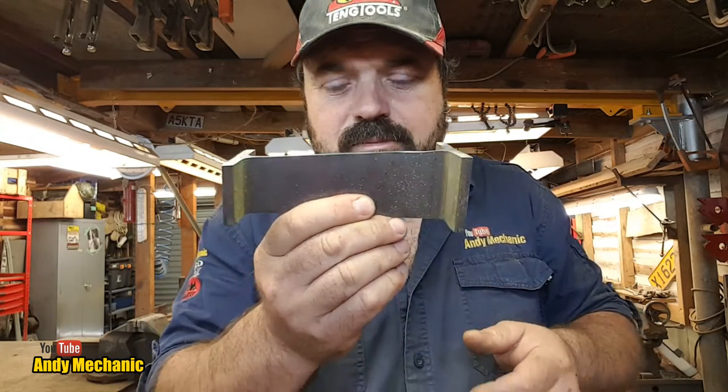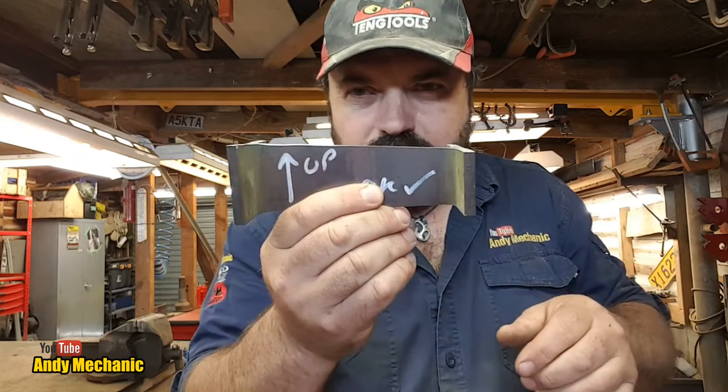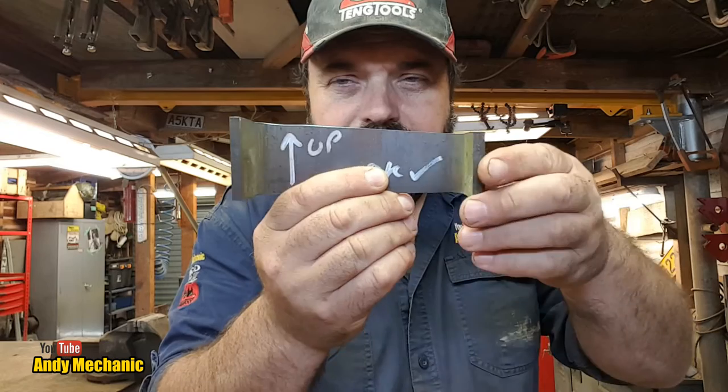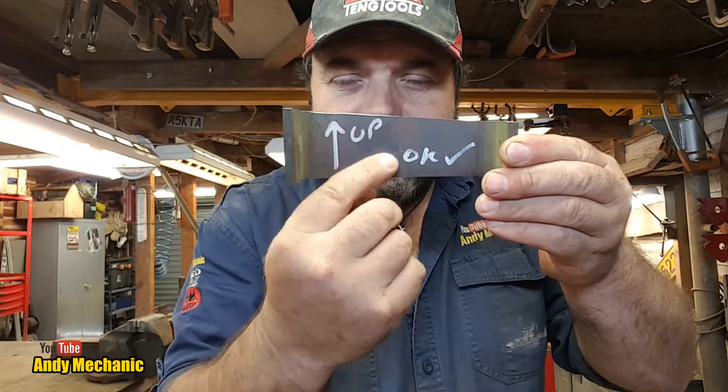Now these feet have to be, if I turn it around so it orientates to the workshop, there is a 4.1 degree incline or angle on that foot, and that's exactly the same to match the incline of this roof. 4.1 degrees, not 4 degrees, not 4.2, but 4.1, just to be accurate. So I've got a few of those to knock up, and of course some more of these eyelets, both very simple things to do, but I need to get them done before I can proceed. Okay crew, too much waffle as always, here we go.